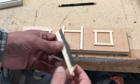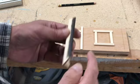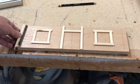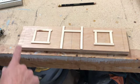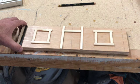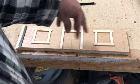You'll notice that the trim boards out here, I've gone ahead. Now these are not the trim boards that are going to go on here, because you see how it's detailed here and it's detailed here, 2 different details. I'm just using this as a sample. However, I paint them prior to putting them on. I paint the body white, and then when I come back over, I get a nice clean edge. I don't have to clean up at all with a paintbrush, right? So that's what I do. You can do the same with the trim. You can paint it whatever color you're going with.